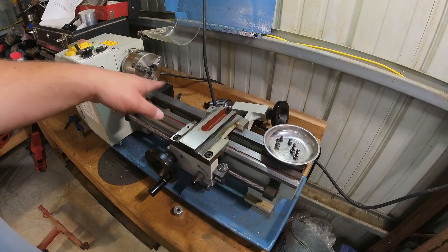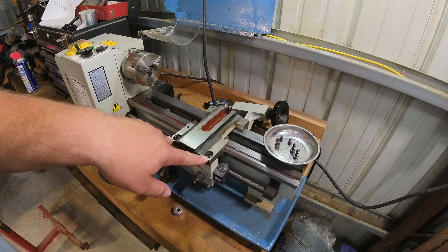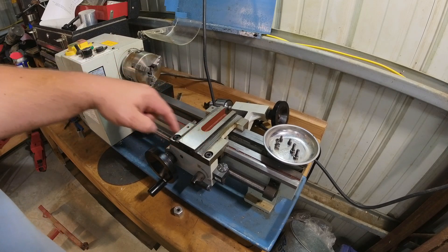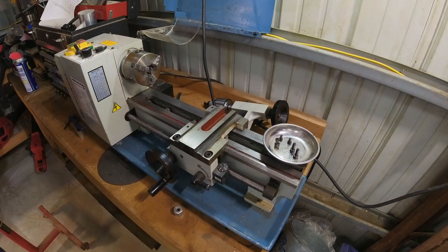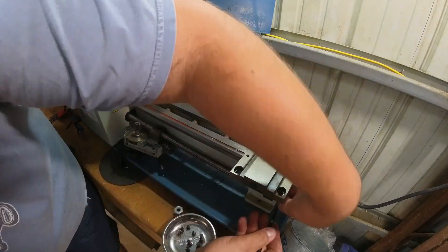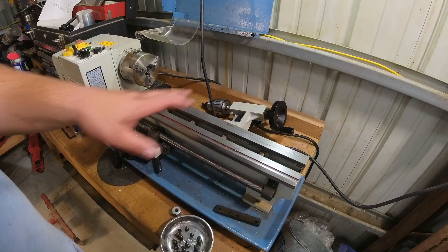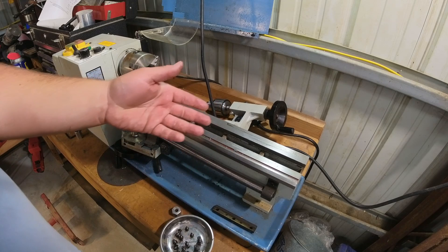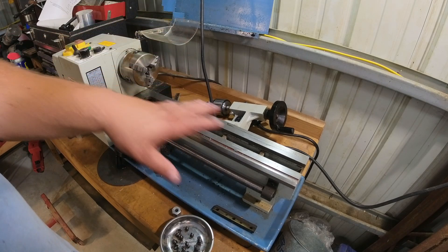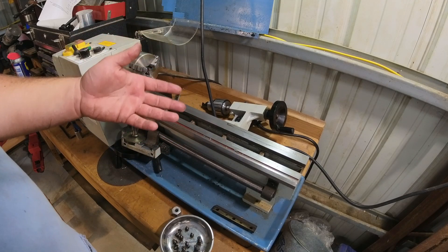The instructions did not say to remove the back sheet metal stop up there. From here I'm going to remove the two socket head cap screws, these two set screws, and there should be six cap screws along the bottom that hold everything together. This piece comes off also — we're just going to watch that carefully. So far this is pretty straightforward. From here it's a great time to do a little bit of cleaning — clean up all the parts so everything goes back together nice and clean. This is a piece of precision equipment and we do want things going on the ways correctly.